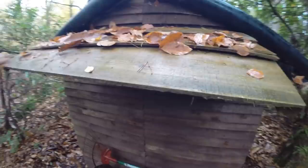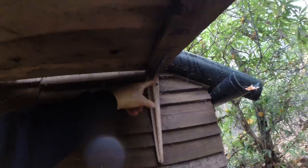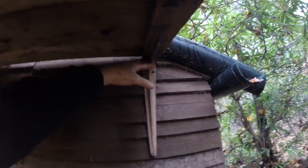So around the back, what we've done here, oh yeah, we put up here, get the leaves off, a little porch overhang roof. I've mounted it on brackets. I put saw cuts in there, bend the brackets down. Otherwise you can't bend a right angle bracket down because the knuckle is too tight. That's a support point. So I've got that there to bend an angle on it so any water drips off, as it hasn't. It's just done that in my face.